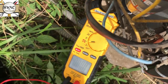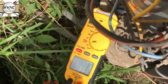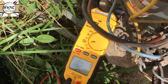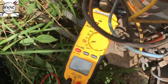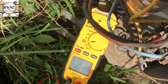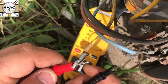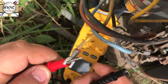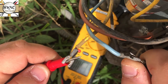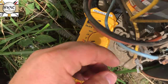We'll put the multimeter on. I'll try to unhook this contactor so we can hear what's going on. Alright, we have continuity passing between run and common. Run to start, we have continuity. And common to start, we have continuity. So we don't have a burnt wire or anything like that — it's not in thermal overload.